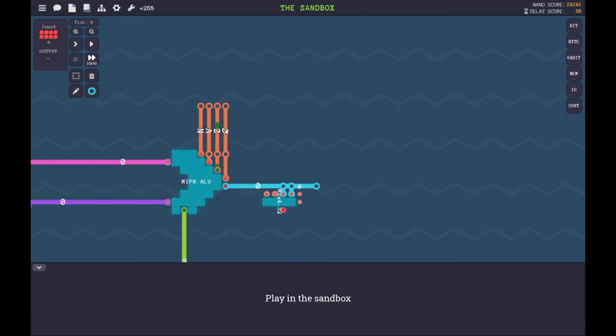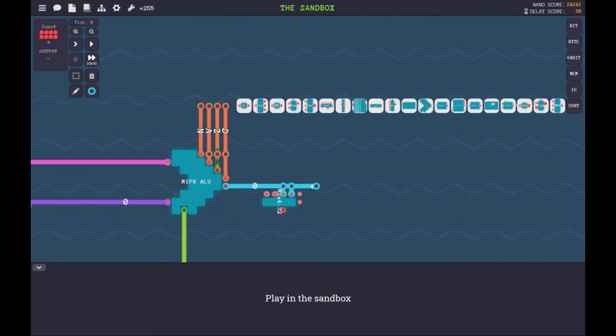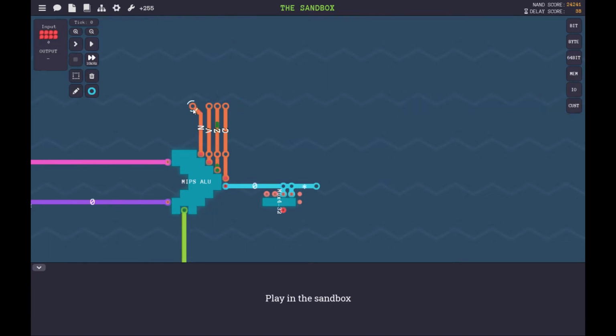Oh, only using the negative flag is actually wrong. There are some cases where that will give you the wrong result. So actually what we want to do is we want to take the exclusive OR of the overflow and the negative. And that one tells us if we have signed less than. What the carry tells us is that we have unsigned less than, and we'll wire up the control signals to pick between the correct ones.